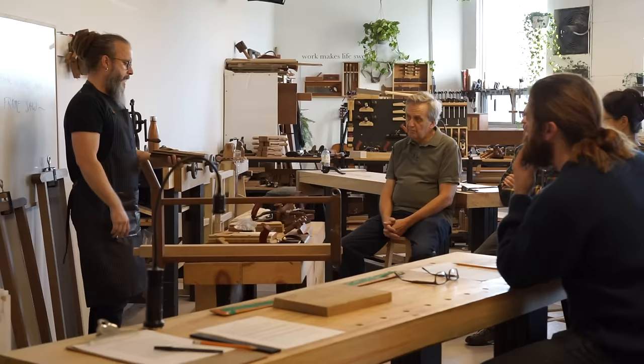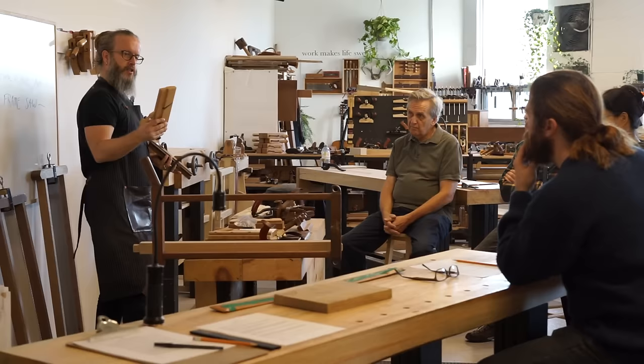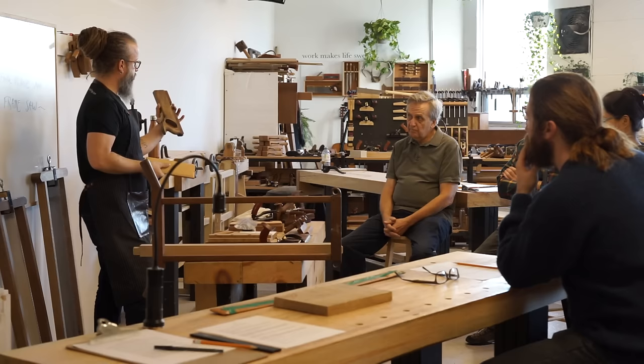I saw this plate and was like, what if that was just a saw plate, bolted to the side like that? And I didn't think it through to the body. At the earliest stages, the first kerfing plane looked like a molding plane, which is a block of wood with a rabbet cut in the side with the saw plate screwed to the side. I don't have that anymore, but that's kind of what it looked like.